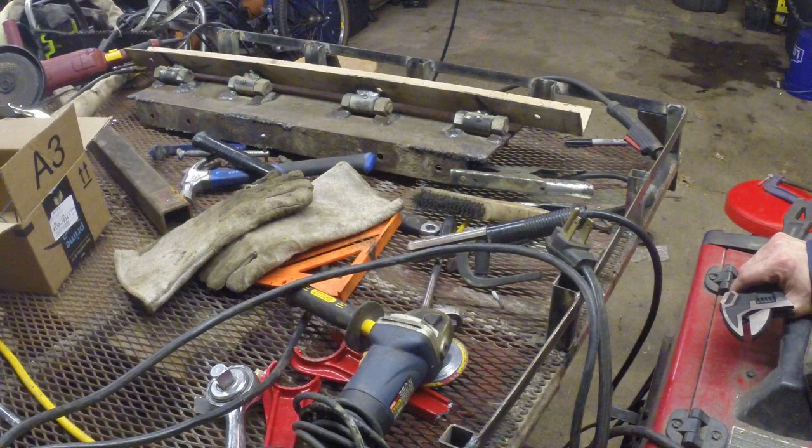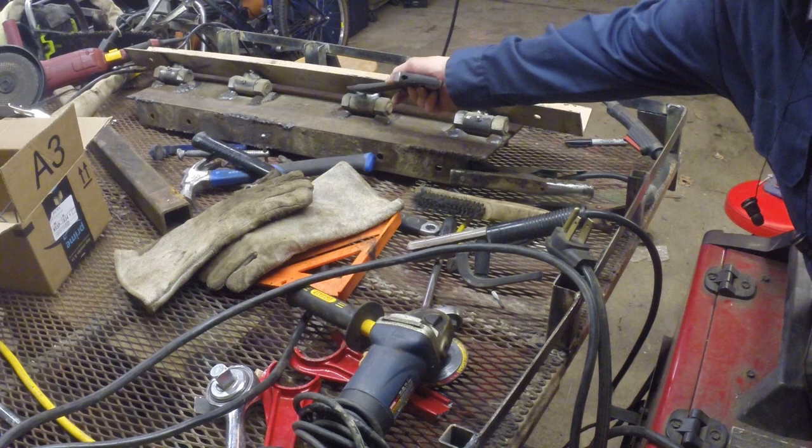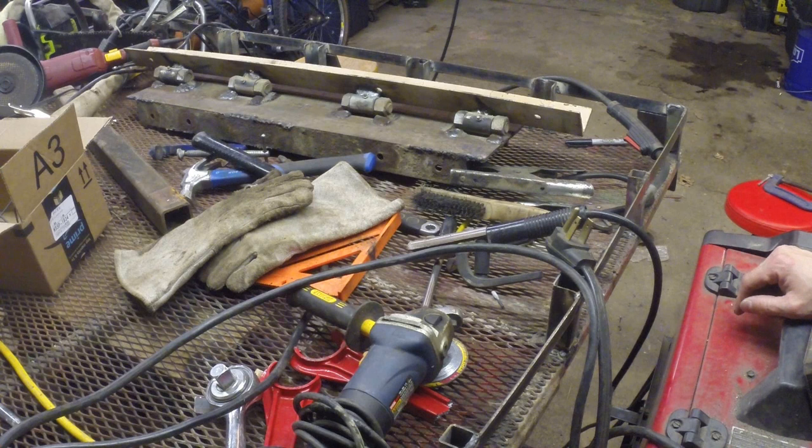This is what I came up with as far as the hinges go. I'm no welder and definitely no stick welder, but most of this was stick welded because I want to learn how to stick weld — and my stick welder is a lot better than my MIG welder and penetrates a lot deeper. So I went with it. I initially laid some beads down with the MIG flux core, then came back and stick welded everything. I had to put risers under here to lift this up, and then I had to put something between there to create a gap — I just cut grade 8 bolts and put them in there and welded on both sides.